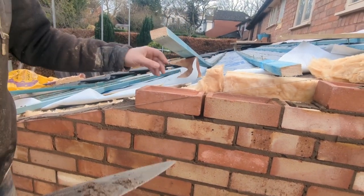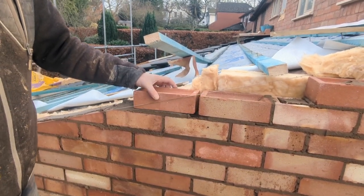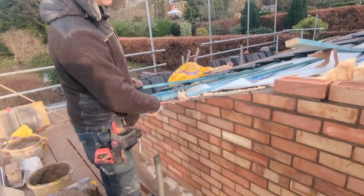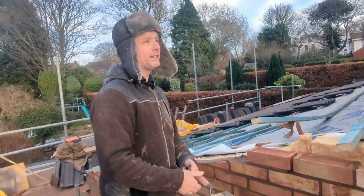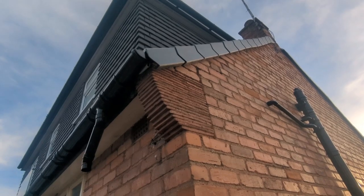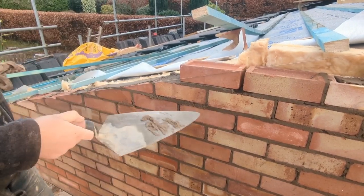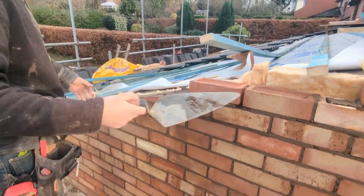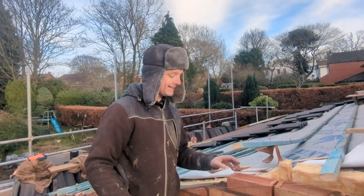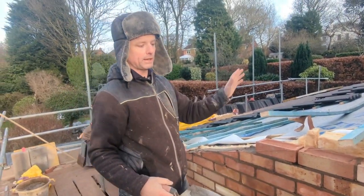It's not the quickest, especially in summer when the bricks are dry and that's just going to suck up all the moisture. But in terms of accuracy, that's the way I'd recommend. In saying that, to get this nice crisp edge - we've got the dry verge to go on, same as that - the bottom of that dry verge will cover those bricks, coming down to around about here. So you won't really see it, we're just doing it to show you. But it's got to be right. If it wasn't going to be seen, or maybe you've got a feature brick on top, that's the best way of doing it I think. So: lay them, mark them, cut them, lay them again - job done.